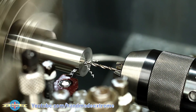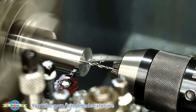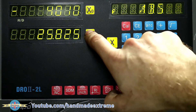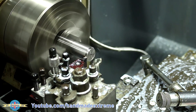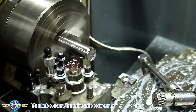I started by drilling the hole at the center which the liquid will flow through. I could then zero the parting off tool on the front face of the part and then come in and use the parting blade to create the step-down feature which forms the top hat. I'm not using any coolant here just so you can see what I'm doing.